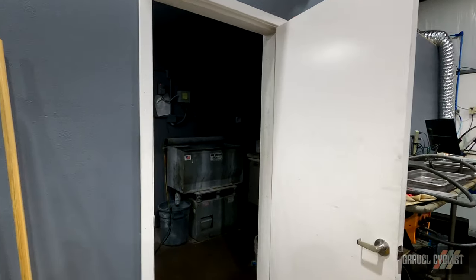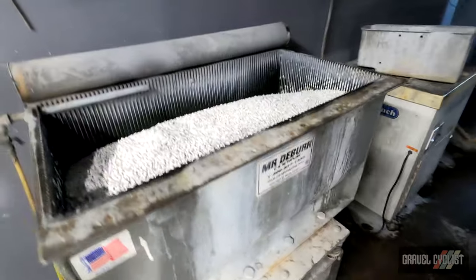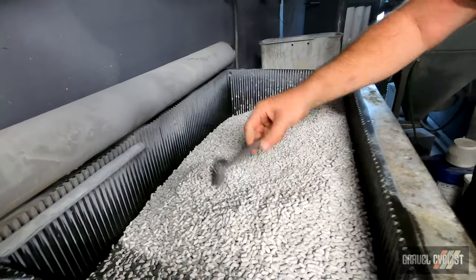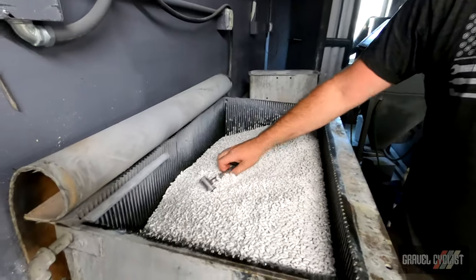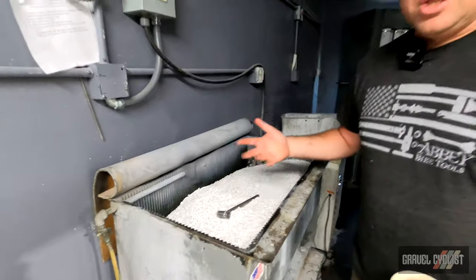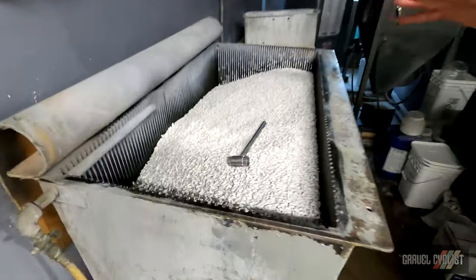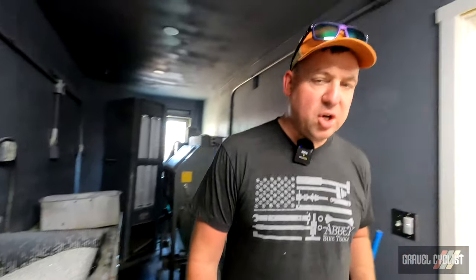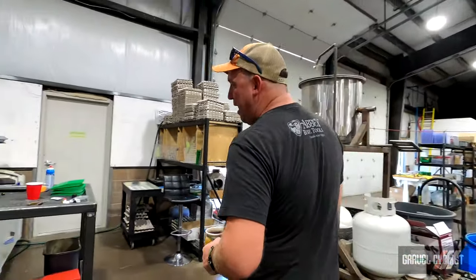In this room — kind of the pain cave — we have the vibratory finishing machines, or what some people would call tumblers. This one is full of porcelain pellets and it literally just shakes the living crap out of the tools until they're shiny. It's a pretty environmentally friendly way to finish these. A lot of the other typical tool finishing processes — chrome plate, electroless nickel, black oxide — are some gross processes. It can also clean up any last little burrs on the spline. Most stainless tools will spend two to three hours in there until they're done.